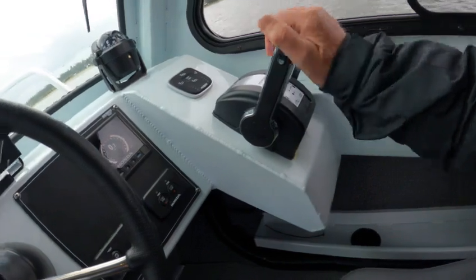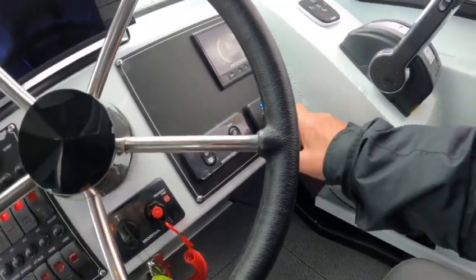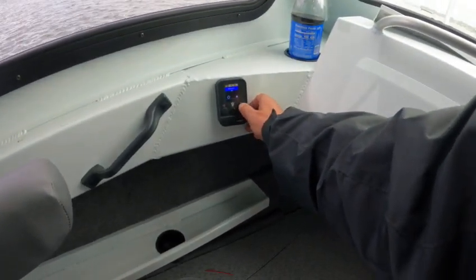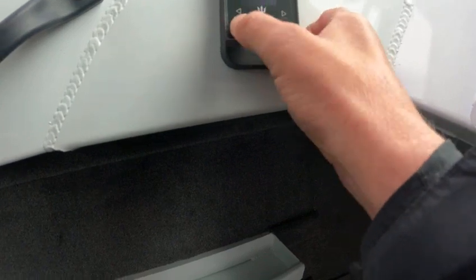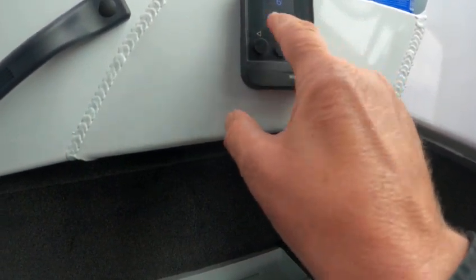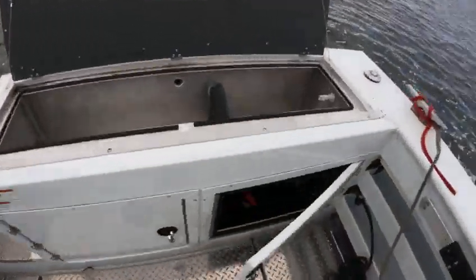So what I'm going to do while I'm showing you all this — I'm going to fire this up real quick. Make sure it's in neutral. You got separate switches here for your trim, port and starboard. Turn the key on, hit that one, hit that one. Now I'm going to start up these electronics — hit this and you got to just hold it manually. Ventilation settings — manual. So you just hang on, push on that one, and then you go over here until it highlights, then you just long press and it says starting.